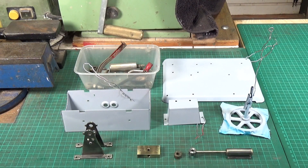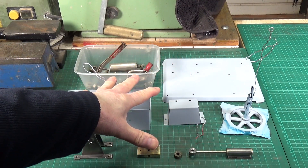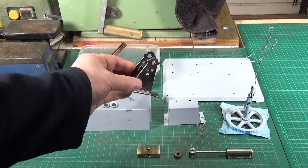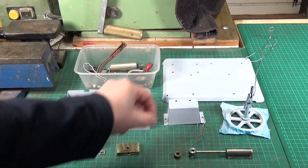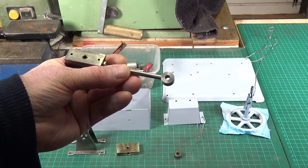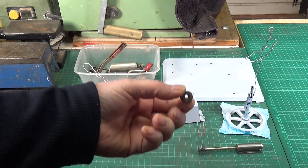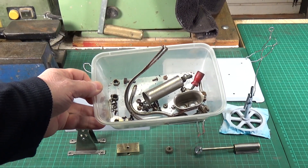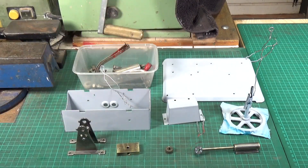Here is where we are with the Emco B43. I've managed to get the metal parts we cleaned up etch primed, but unfortunately the weather has taken a turn for the cold here in the UK - it's currently only about 7 degrees C outside, which is way too cold for painting. I've cleaned up the crank support and the engine block - both came out quite nicely. I've made a new conrod end out of a piece of mild steel bar and that's come out quite well. I've still got a few bits and pieces to clean up, and we've got to make a new regulator screw knob, but it's all coming along quite nicely.